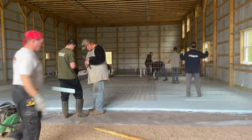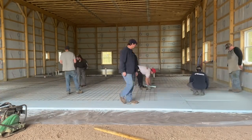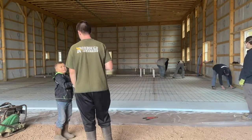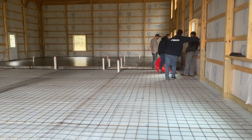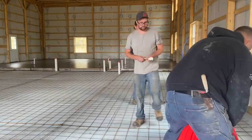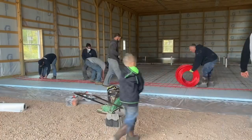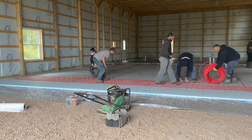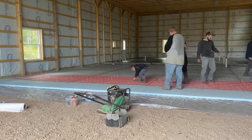Here we are guys, putting the wire mesh down. The concrete is all in and while we wait for it to cure, we're putting wire mesh and tubing down for the next section. I'm only going to stay with one other guy to finish this concrete — all the other guys will take off after we get the tubing down. We tied the wire mesh to itself to keep the grid nice and lined up, because we use the grid to tie the tubing down. They're on 6-inch squares. The second section ended up a little bigger — about 31 feet — so just over 1,200 feet of tubing.